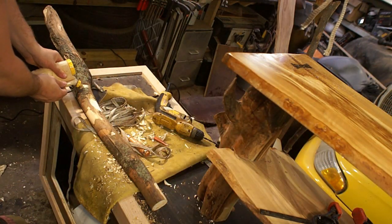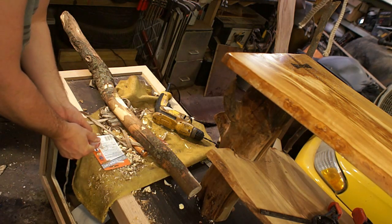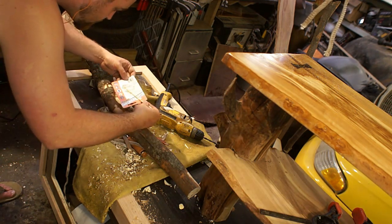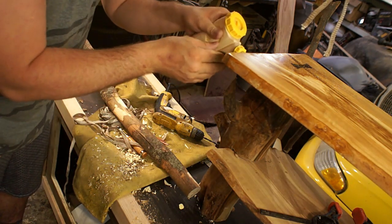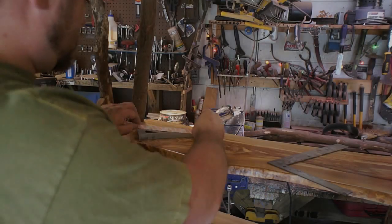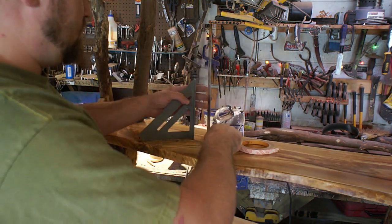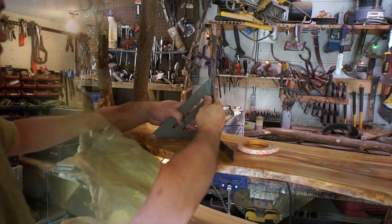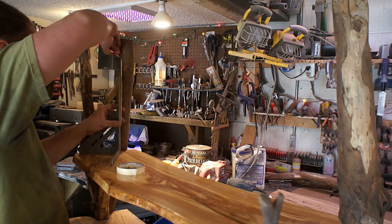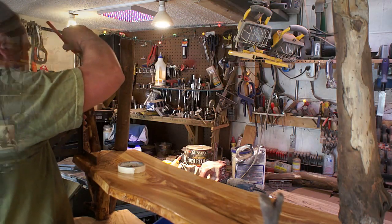Doing dowel pins for the top and bottom. I'm using two different types of glue here: for tight joints I'm using wood glue, and for ones where there's going to be a little bit of a gap I'm using epoxy so it'll fill it in. Wood glue needs a really tight bond — there's not much strength in the glue itself. I made a contraption — two squares put together to form a triangle on their base — with a little marker on it to give me a reference and make sure all the cuts in the top piece were level so that top shelf would sit level compared to everything else.